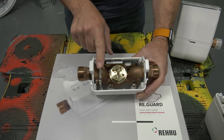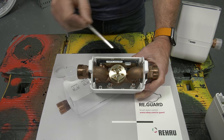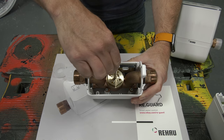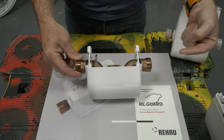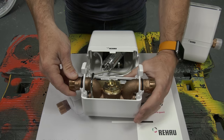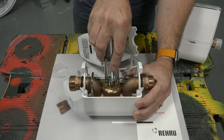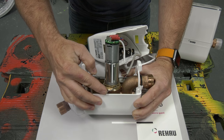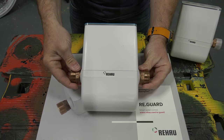There's also a small Allen key here - if we actually have to manually work this valve to open or close it, we can pull it out of its housing and pop it on here. That's the closed position, and that's the open position. We just pop it back in there. Because our water is running this way on this installation, I'm going to pop it back together ready for that type of installation, then fit the valve head and the circlip. Now that's ready to be installed on our pipework.